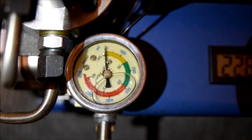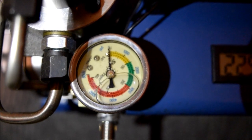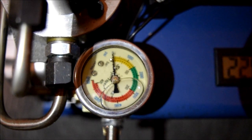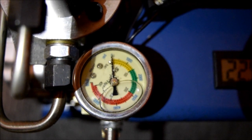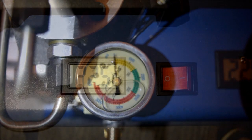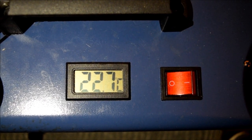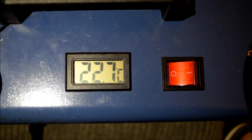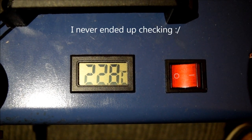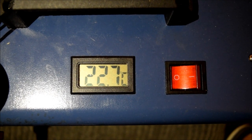Here we have the pressure gauge. The yellow zone goes up to 1500 PSI, green up to 3000 PSI, and red up to 6000 PSI. We're going to go to 4000 — don't worry about the red. We're not going to 4500, which is the maximum pressure of our tank. This is the temperature gauge — it's reading about room temperature, which is 22.7 degrees Celsius. It's very important to monitor the temperature as you're filling. You don't want to go over 65 degrees Celsius.